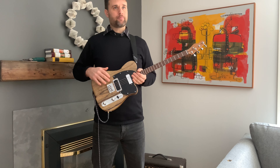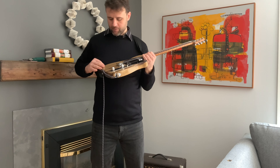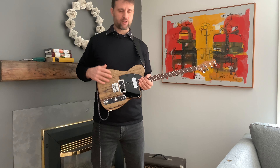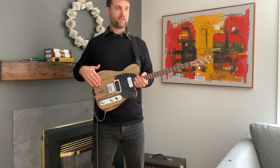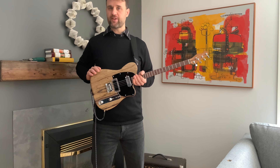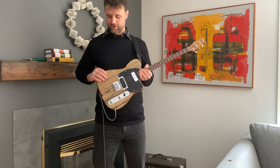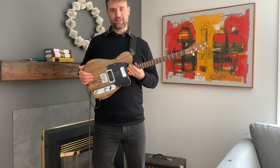For the body, the first thing I did was coat everything in some milk paint and then sand it way back, but I left some of the white in the open pores to reduce the yellowness in the guitar, because I wanted it to match better with the neck and the client wanted less yellow in it. Once I did that, I epoxy-coated everything for pore filling, leveled it, added a couple more thin layers of epoxy, then a bunch of true oil after that and some wax. You end up with this nice satin finish that's really hard and feels super great on the body. I love this finish — I'm going to definitely do this more often.